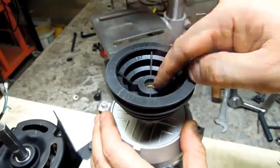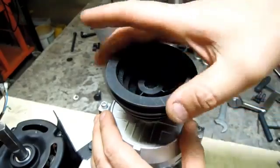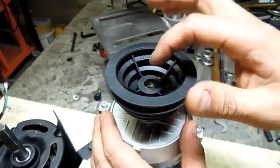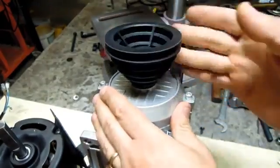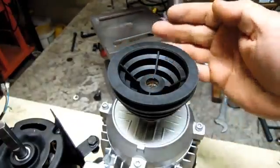These have a steel bushing molded with the plastic on the inside. The plastic itself is quite round. It's just that position. I'm not sure if I'm going to be able to fix this. I'm going to try to ream that, but I think I may just have to make a new pulley. The same one on the spindle was surprisingly good, so I left that one on there.